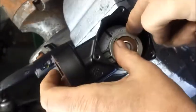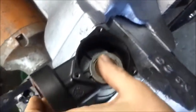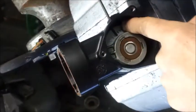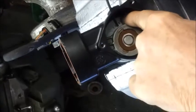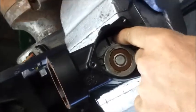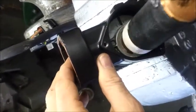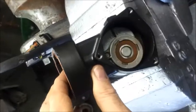You then get your Allen key, and with the line horizontal, you then just nip the grub screw up. You then can just gently tap the end of the connecting rod just so you know that it's fully home. Rotate the counterweight so that your piston seal is at the highest point.